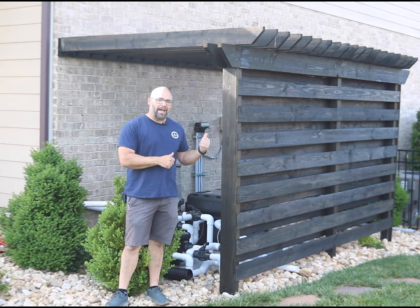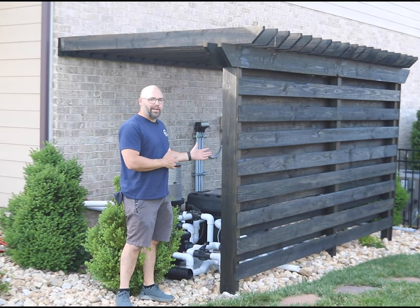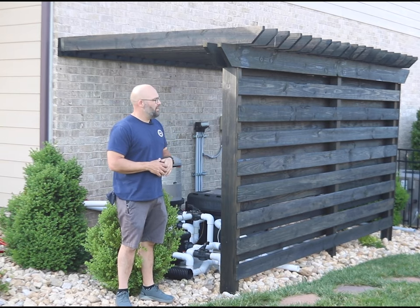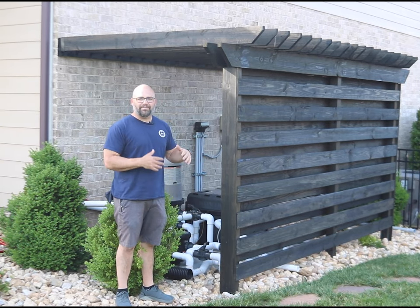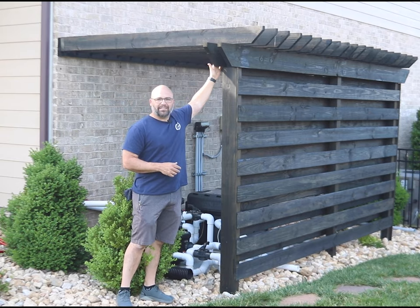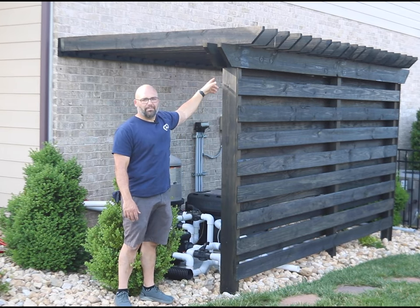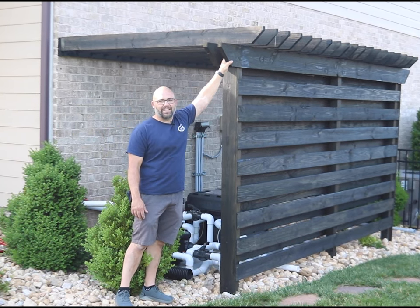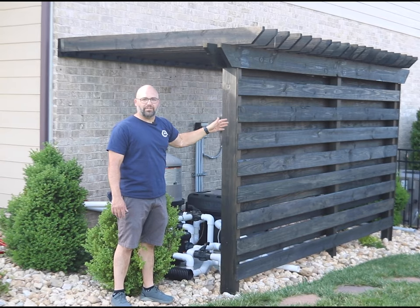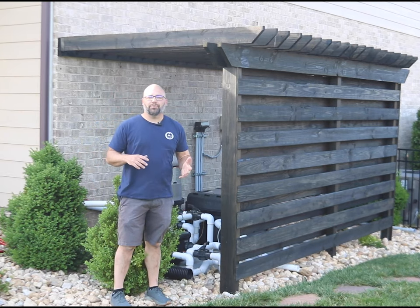All right, that does it for us today. I'm really happy the way this turned out — it's an awesome structure that looks really good on the side of the house. It provides great cover for the pool equipment and adds some shade to help with wear and tear. There are a few things I did wrong, like the header and ledger height. Also, if I had to do it all over again I would not have placed the L-brackets on the inside of the header before installing it. I should have installed that header, then done my joists, put the L-brackets on the inside, and then installed the other header — that would have hidden those L-brackets completely. Hindsight being 20/20, I'll definitely be doing that on the next two pergolas.